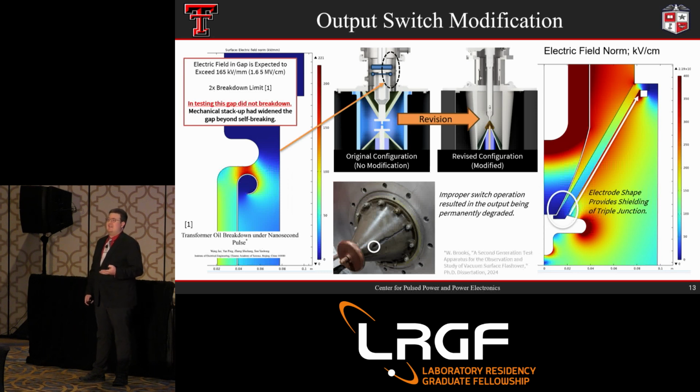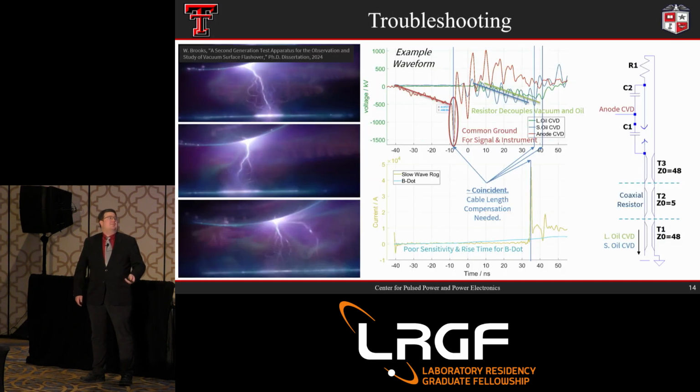And ultimately, when we did the analysis and looked at what we had, what we found is, from purely an electrostatics perspective, that insulator was going to be under a lot of electric stress no matter how we operated it. Fundamentally, it was going to be at risk of being a flashover location or a source of arcing as we pushed to higher and higher regimes. Because again, these almost perfect samples are fantastic ways to find all the other locations on your system that break first, and inevitably do break first. But with a little hard work, you can make arcs in the right spot, mostly right spot.